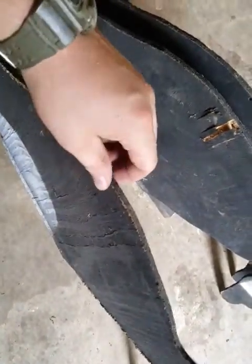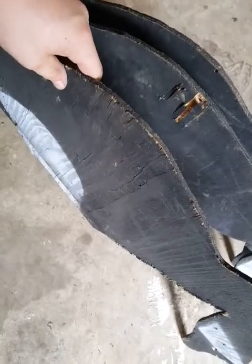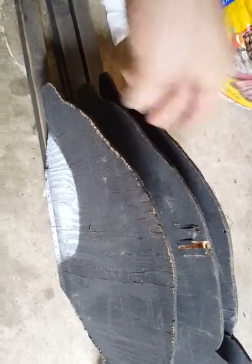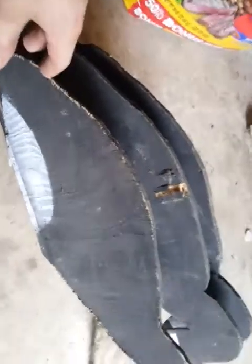I make all my own silhouettes. I have a buddy that has a bunch of real geese and I'll just take a silhouette from him. This is eighth-inch plywood — I ended up getting 57 sheets for free from work, which worked out pretty good, otherwise they're like 15 to 20 bucks at the store. I'll usually do blanks, take three or four of the blanks, screw them together, do one outline, take a jigsaw and do the pattern — then I'll end up with four or five decoys instead of doing one at a time, which is really painstaking.